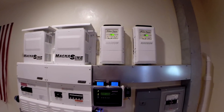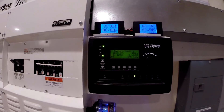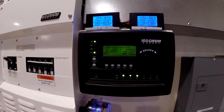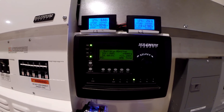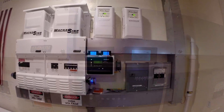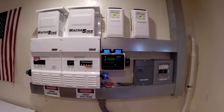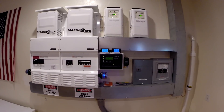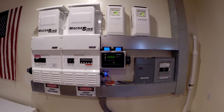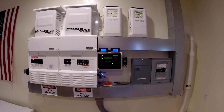At 5 p.m., 35 amps coming in at 57 volts, putting 16 amps into the batteries. We're at 100%, plus 4 amp hours up. At this point, just about everything is shut down — the air conditioners are off, pool pump's off, the water heater's off, and we're done with the dryer. Just the base loads are running now: computers, lights, stuff like that.